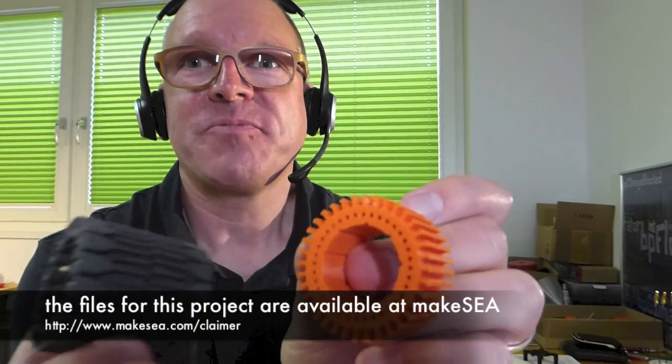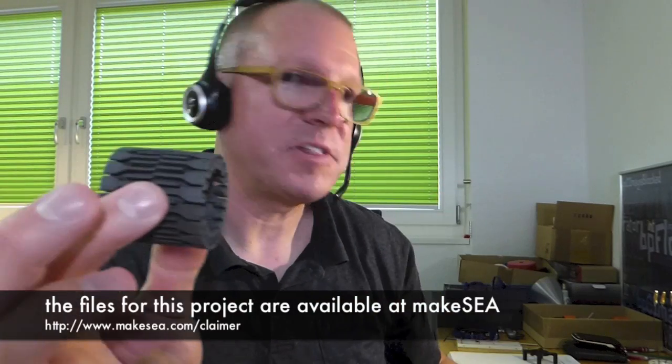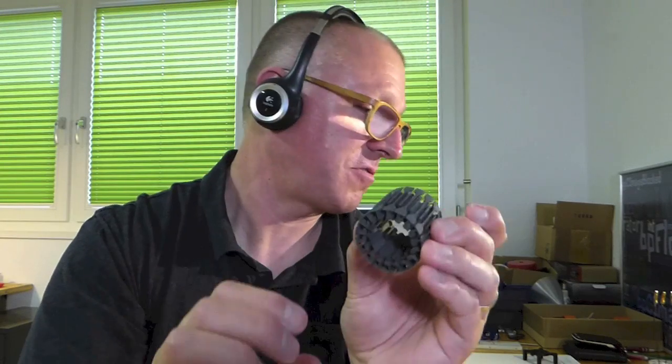For the 90 watt version of the motor, I improved the winding core a little bit to simplify the winding — this version with tooth heads. There's a straight version with lines which is difficult to wire and requires the handle. Then I built another core with special tooth heads, which allows winding without needing the handle, as the tooth heads guide the cables properly. The core also has slightly different internal dimensions to improve efficiency and make many turns of winding practical.